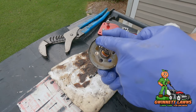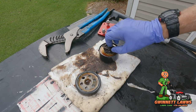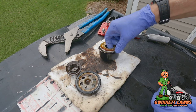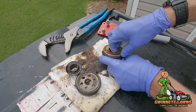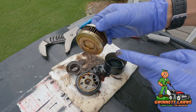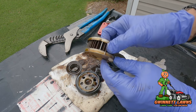I use Wix filters normally on the mower — I'm not opposed to the Kawasaki brand, but these are super heavy duty. When I examine a filter, I'm looking at the inside to see if there's any debris. This here is an anti-drain-back valve. Here's the actual filter media — it's got metal caps and paper pleats in there. I look in here to see if I spot any chunks, any metal, anything like that.